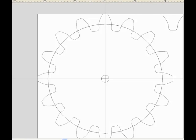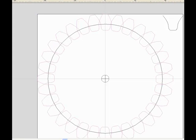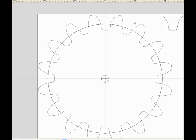In order to do the other side of the tooth, of course, we'll unwrap from the other direction on our base circle. The base circle is also important if we want to figure out how to machine this gear to get nice involute shapes on its teeth without having a bit which is shaped like the teeth.